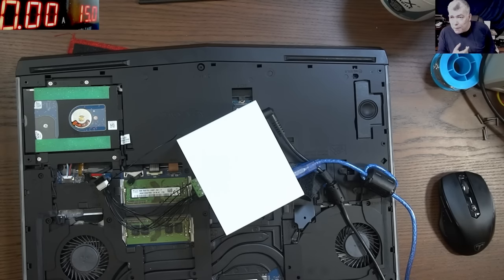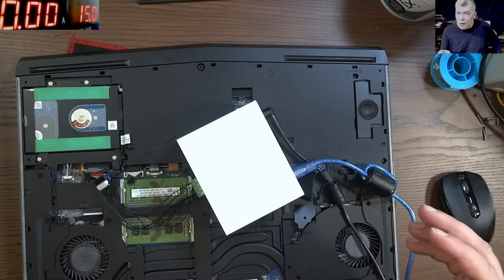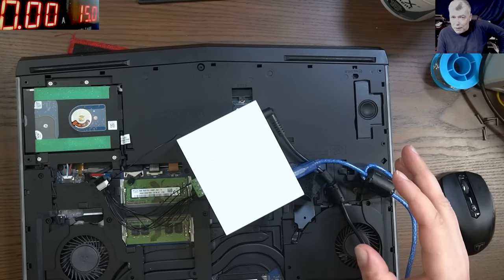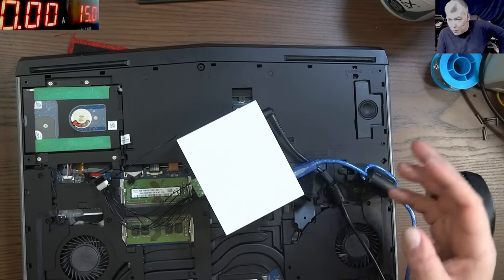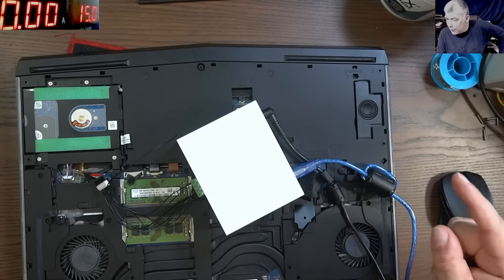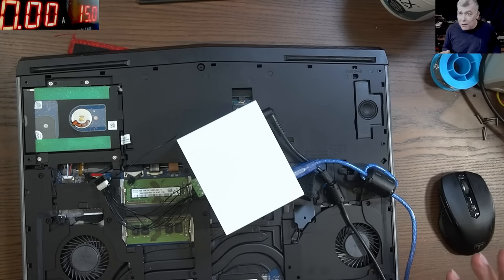There are customers who actually know what is going on in this business with computers. And let's be honest, at least on this channel. We both know a brand new battery only lasts about 3 months, and that's how much warranty you give for it. A new battery also comes with lower capacity compared with the original one. So if I have to choose for a customer, as I did in the past with the guy with the Acer Swift, I prefer to buy a second-hand original battery instead of a brand new one, because a brand new one is a copy battery.